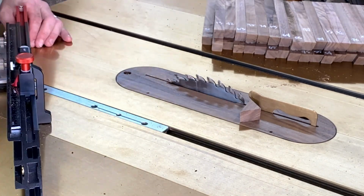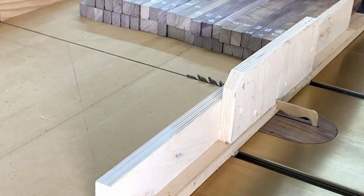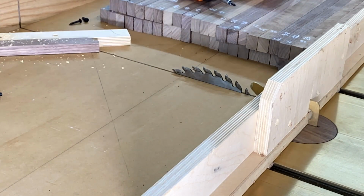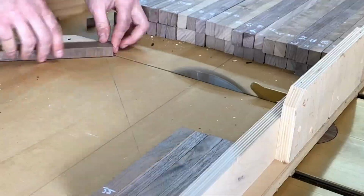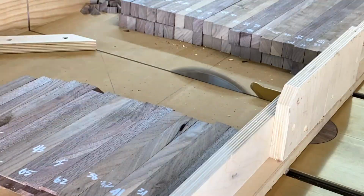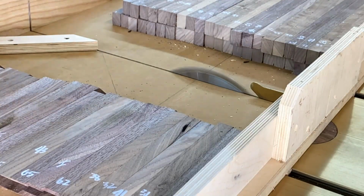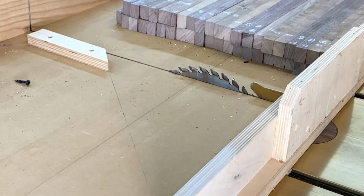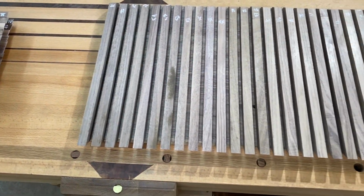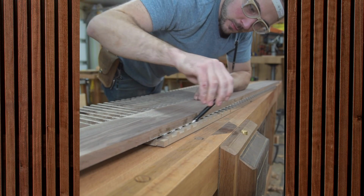So the drawer fronts where they meet the seat were mitered, so that was like 42 separate miters to line up all at exactly the same time. And then putting these slats in cross grain with a hardwood case construction required that movement was taken into account.